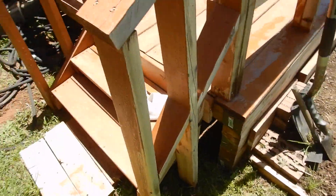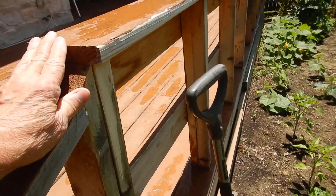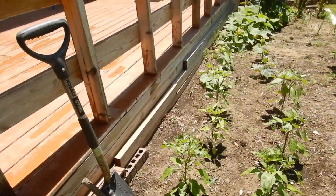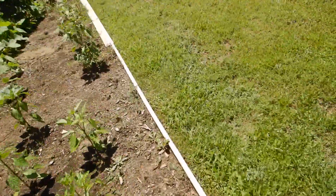These handrails are too short. They've got wood to ground contact. These handrails are not graspable. This guardrail is too short. Then we've got wood to ground contact here, and we took this wood all the way across it, all the way across here.